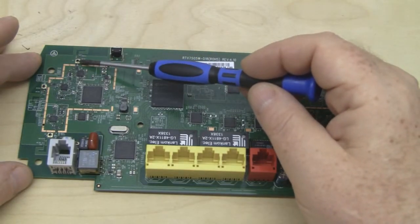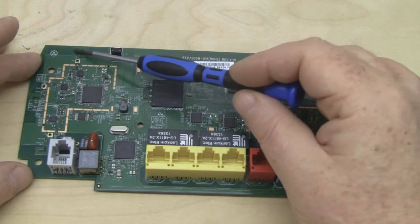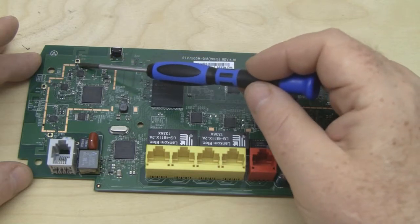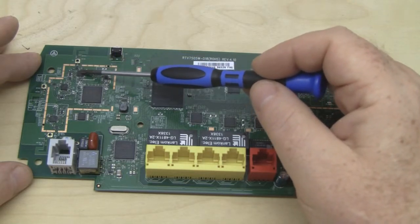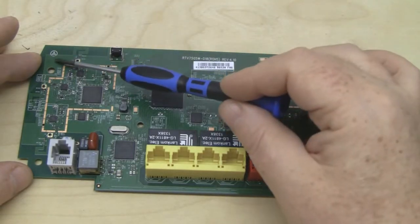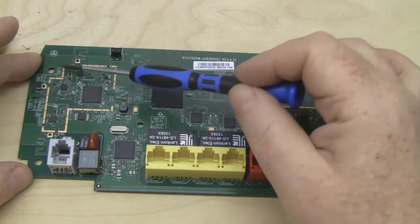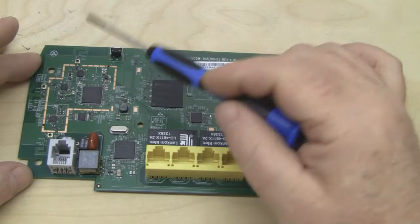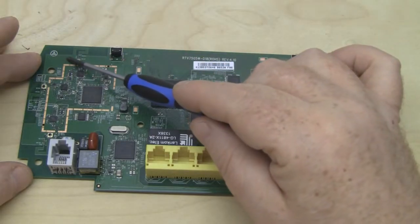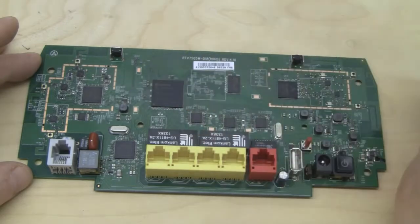What I'm going to do is remove these test points, break the connection to the resistors and PCB antenna, and solder the coax directly onto the feed line that goes straight into the chip. Then I can solder the ground plane to any of the copper around here — all this copper line around here is ground plane.